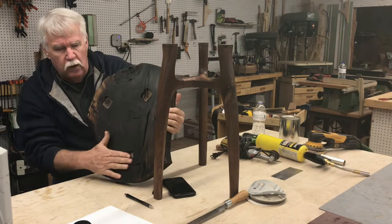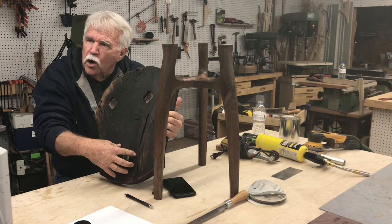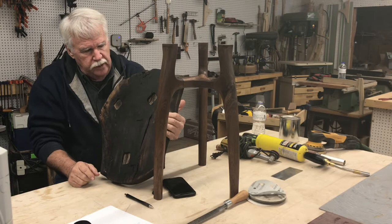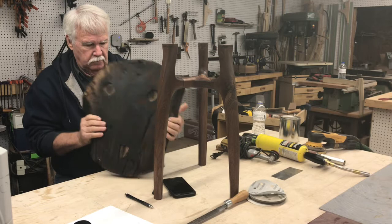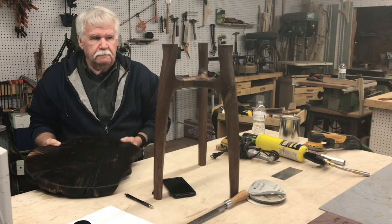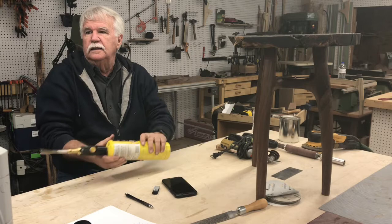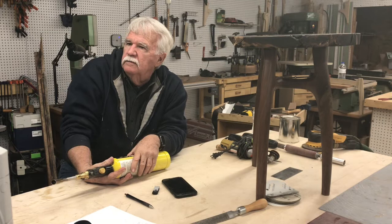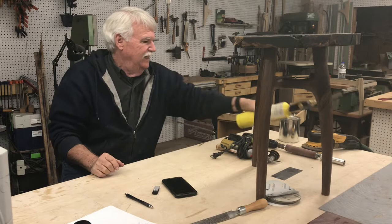The pocket joint is how we cut these guys out and make them fit perfectly. You make this guy, set it on the top, then put plywood marker spacers down to use as a guide for a router bit — very, very simple. The first video covered that pretty much exactly. It's the same thing I used on my coffee table — a round table with five legs. You can use the same joinery for a chair, where the seat and base fit into the legs using the same pocket joints.